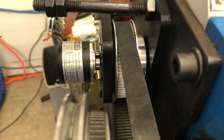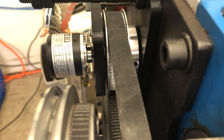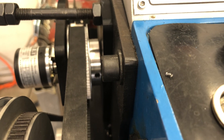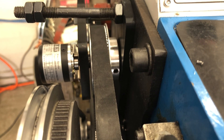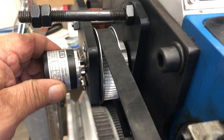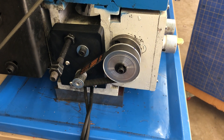With the 3D-printed bearing plates, we don't actually have a load on the encoder itself. The encoder, instead of having an external shaft, has a hole where you can tighten it up on top of a shaft. That allowed me to make one complete shaft that goes from the first plate with a bearing, through the pulley, into another plate with a bearing, and then it has a nice float mount so it wiggles a little bit in case there's some errancy in the shaft.